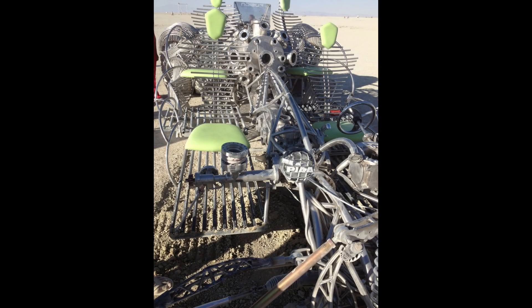The reason I'm showing this animation is to relate the story of how the frame broke at the 2012 Burning Man. I was chauffeuring my friend Radnoff and a woman on a playa date — their date, not mine, I was just a chauffeur. We were driving around looking at art out past the temple in deep playa when suddenly the frame broke. The top part bent and the bottom broke. The joint which failed was the one represented in the previously shown animation. The frame broke at the bottom because the vacuum chamber weld had failed — that tiny little vacuum weld just wasn't strong enough in tension. The truss bent but wasn't broken. Unfortunately I don't have any photos from the side; documenting this wasn't the first thing on my mind. It wasn't drivable.